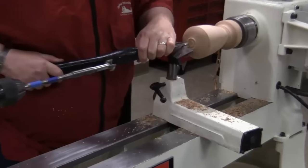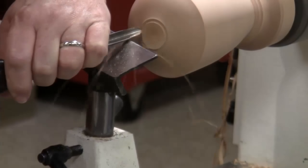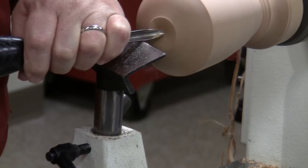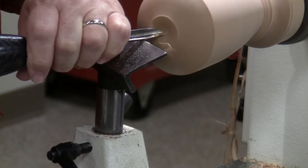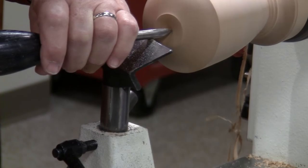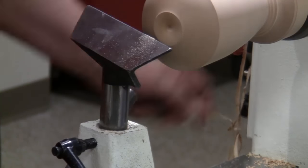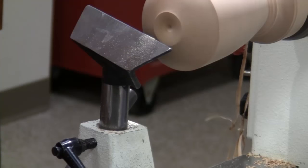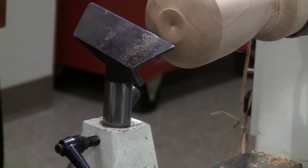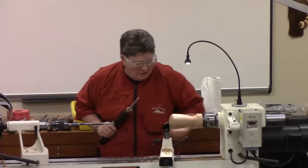Feel that little bit of vibration? Or hear it? That's because it's out over the edge a little bit too much, a little longer than it should really have a support out here. Now, the most important thing is to give yourself that little recess, a little track spot, because you've got this little point guy here, and if you've got a piece sticking up, it's going to track around the outside edge of that. So make sure you've got the point for it to follow in.